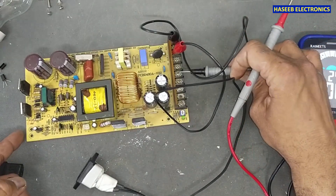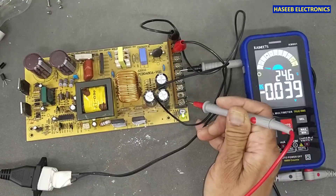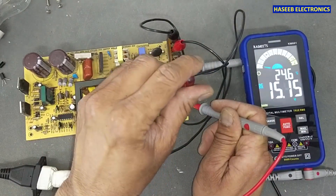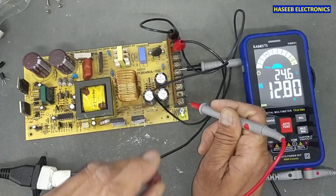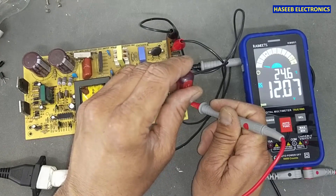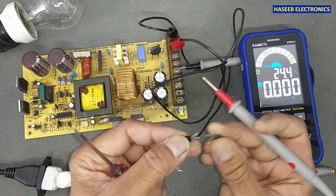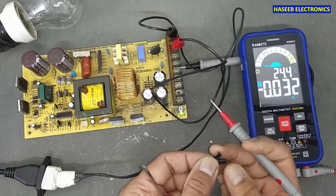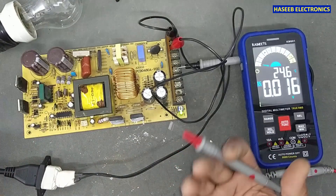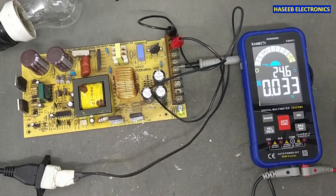Let's apply power and check the result now. This time we have 15.49 volts, and if I try to adjust — that's excellent! Now we have control. Before this, the power supply was fluctuating from 17 to 19 volts, but this time it is stable. There is no fluctuation. The lamp is stable now. We replaced these two transistors. Might be it is due to overheating when it was working at full load condition and the fan was stuck — these transistors were damaged. We can call it material failure.